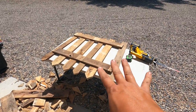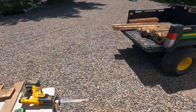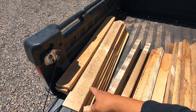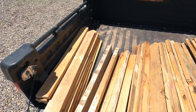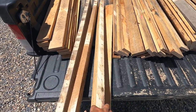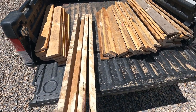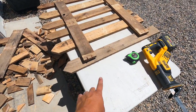These are not attached yet and I haven't spaced them properly, but I've got all my pickets right here in two separate piles. This pile was the most uniform in both quality and size, so I decided to keep those for the front panel. These are for the back and side panels. And then these are the two-by-fours - these are going to be my corner posts. Typically we use four-by-fours, but since it's not permanent, two-by-fours are going to work great. Like I was saying, I don't have one continuous board to run behind a full 10-foot section.